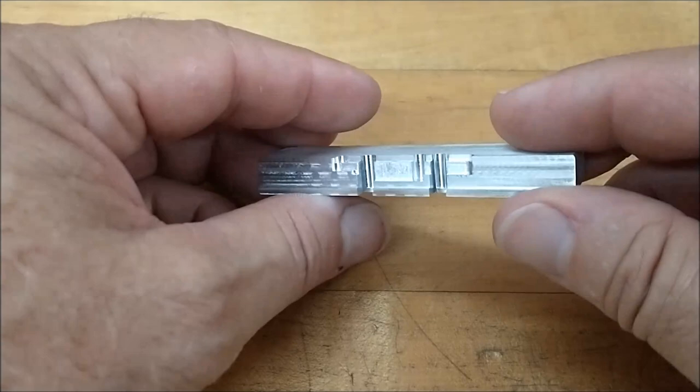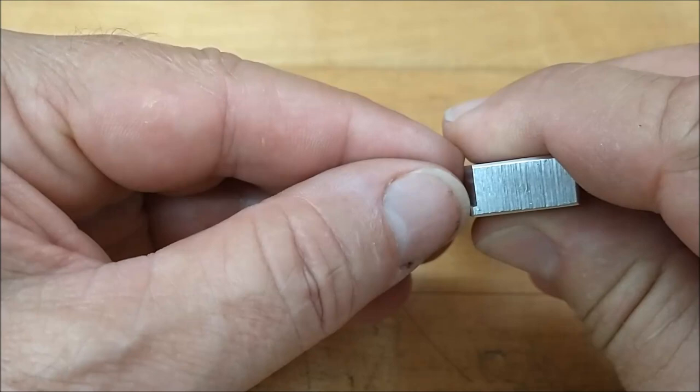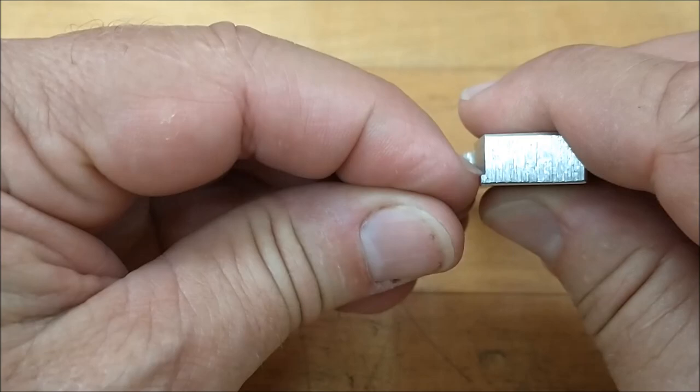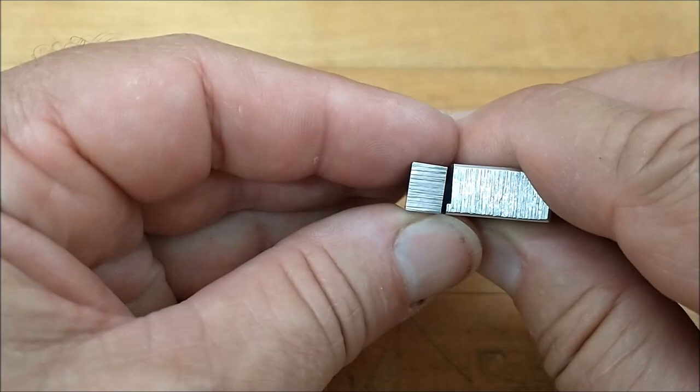Let's take a close-up look at the fixture used to do that little keyway. I think it is really important that you understand what's going on. It may be very helpful in the future. This step right here is thinner than the thickness of the material that's going to rest on that shelf. That is number one. That allows for the movable side jaw to come in and squeeze it to a thinner gauge than the part held, okay?